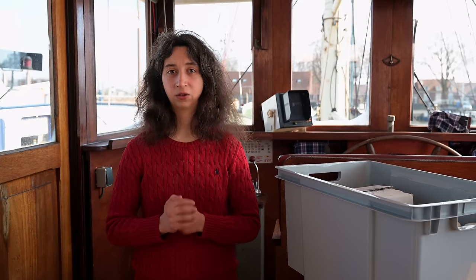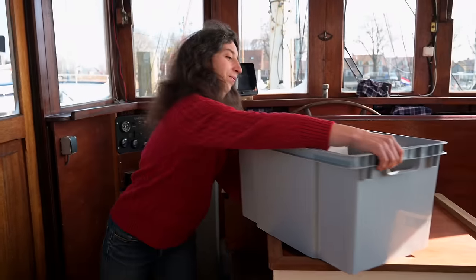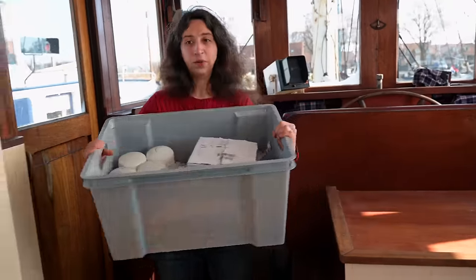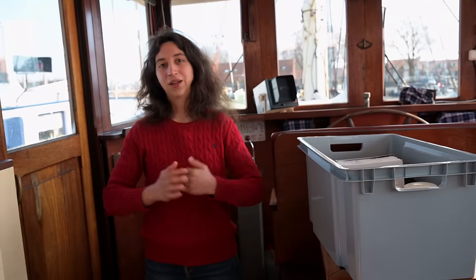We found a lot of dirt in the filter, which was kind of unexpected. Since we do have a day tank and a drain on the bottom, we always check the condition of the fuel before we start the engine, and until now, we never had problems. So the dirt must have been sitting there for years. Even though the boat came with a whole box of spare filters, no one ever bothered to change them. Luckily, the filters caught all the debris and it didn't damage the engine. We cleaned everything thoroughly, and the last step is to put it all back together.